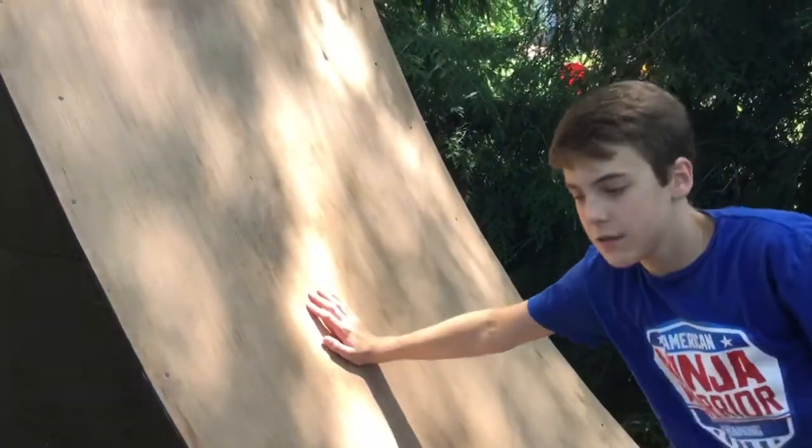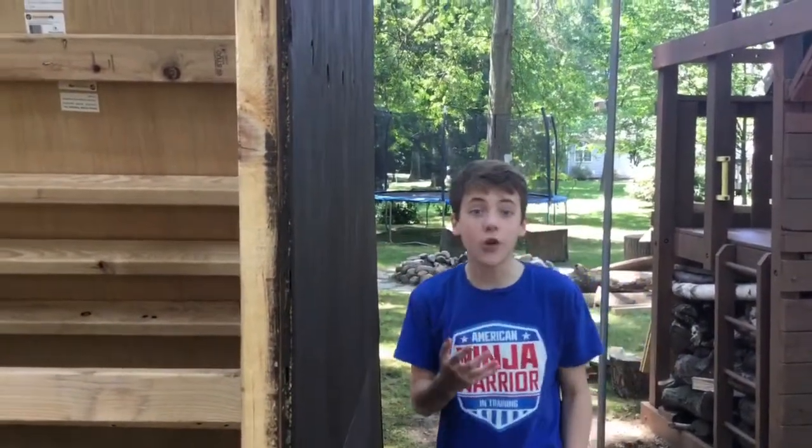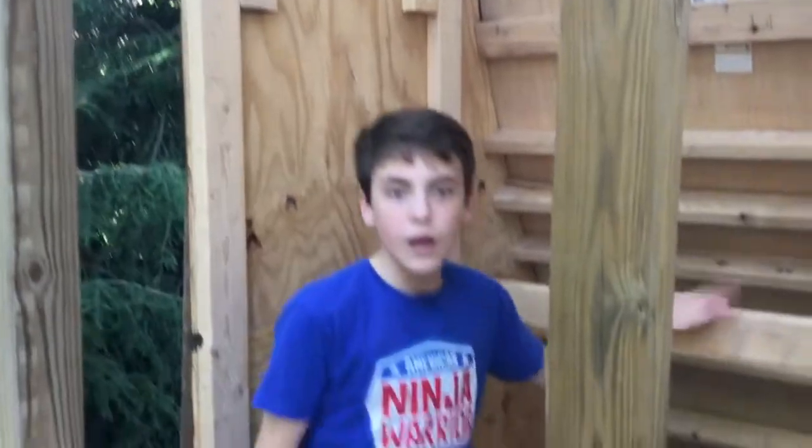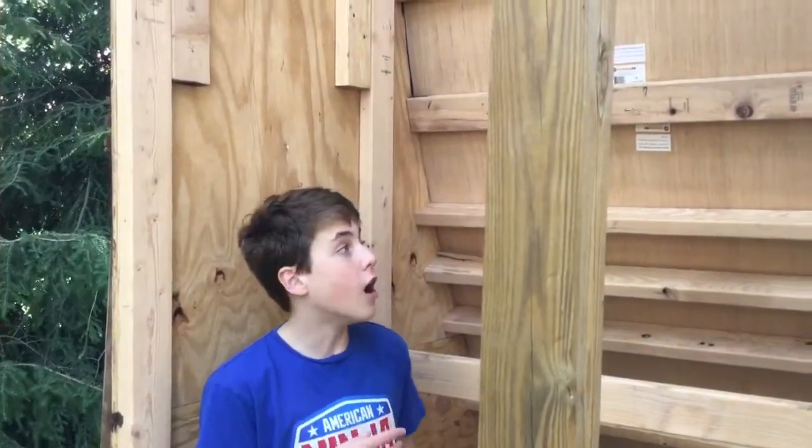And we also want to show you what kinds of nails we used. So let's come along to the front and I'll show you. When we were putting in our Luan, these nails right here, those are 2-inch nails. The ones on the sides, the ones that are holding in the regular boards that are holding up the Luan, those are 2.5-inch. The really structural ones, like the boards that are up top there, or this board right here, that would be a 3.5-inch nail, or like that board right there, 3.5-inch nails. So the structural ones are 3.5-inch. The ones that are supporting the Luan, like these little ribs here, those are 2.5-inch, and our Luan is 2.